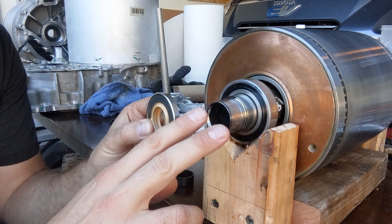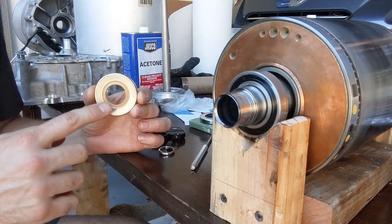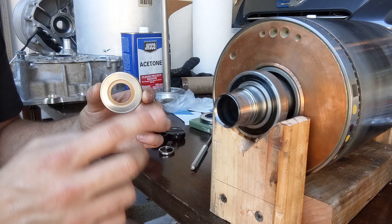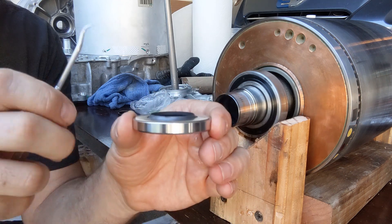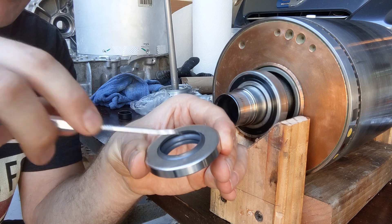Because there's very little space. Before you try to fit the seal on the shaft, clean the shaft completely with something that leaves no traces — in my case, acetone. I damaged this seal while mounting it. What happened? I tried to push it on and then the excluder lip over here folded partially back.